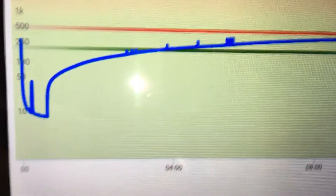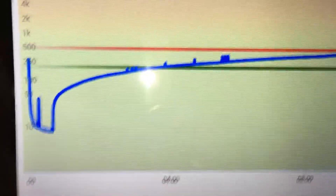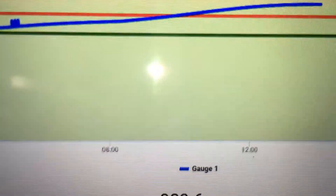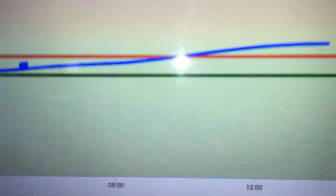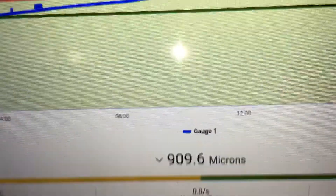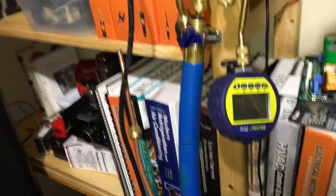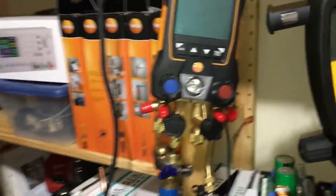Somewhere just before four hours it hit 200 microns - the decay of the vacuum reached 400. Going over there's eight hours, twelve hours, and right around where my shiny spot from my light is, coming straight down, it looks like you're almost 10 hours. By 10 hours the manifold vacuum decayed down to 500 microns, and right now it stands at 900 microns.